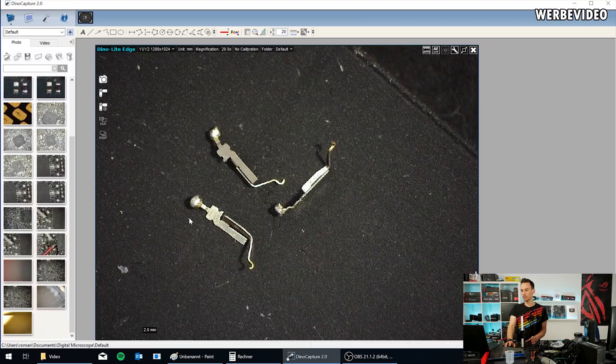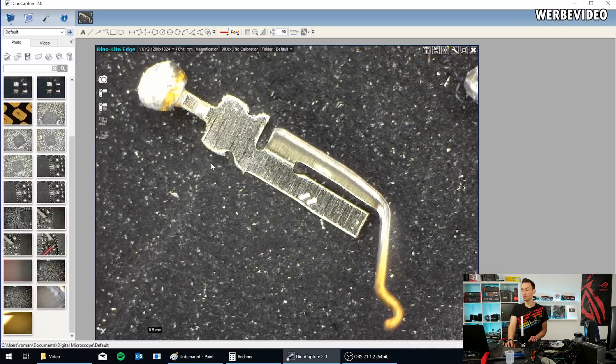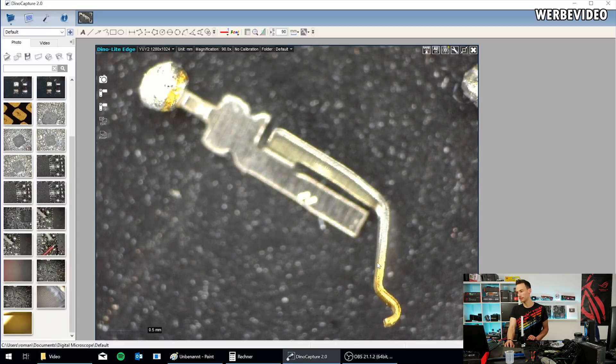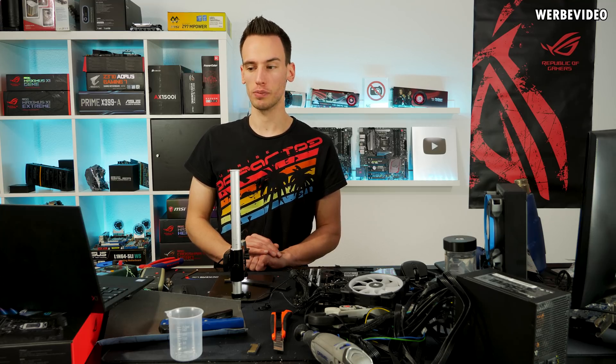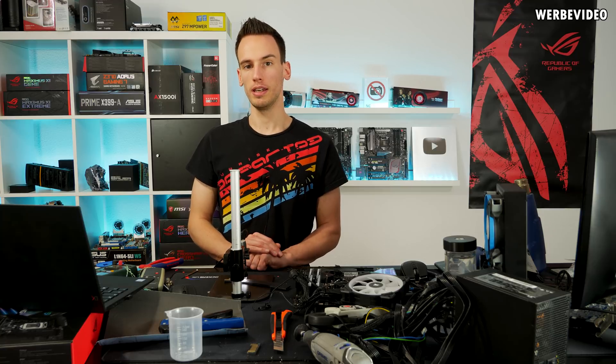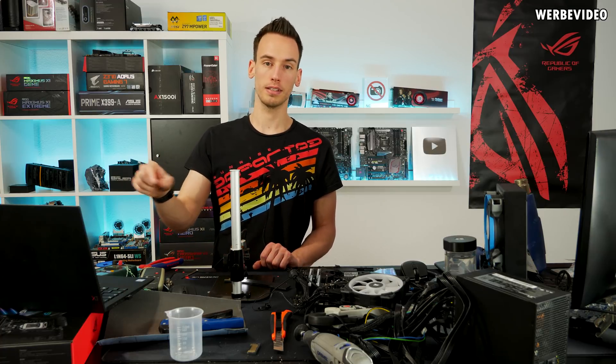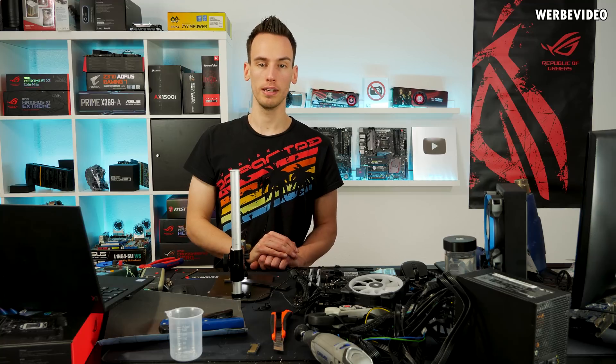Zoomed in at 90× you can see how small these pins really are. Top left is where the pin connects to the PCB; the very thin part goes into the plastic socket body; then the folded metal section leads to the hook — visible bottom right — which actually touches the CPU. The question is how much current such a pin can handle before taking damage, so I'll solder one pin between two thick wires and run current through it with the adjustable PSU.